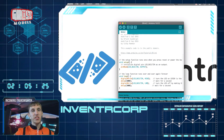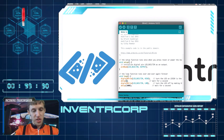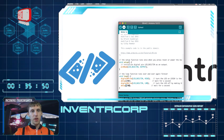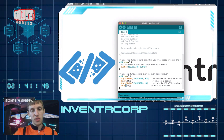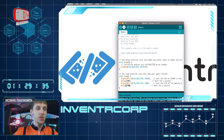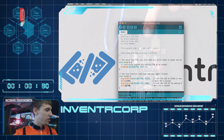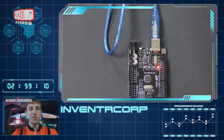To quickly show you guys that example, I'm going to flash it on the board with a different amount than what was previously on there. So if I do instead 250 and 250 and I upload that to the board again, making sure that the USB serial COM port is correct and the syntax has all been verified. When you hit upload, it will verify it for you, so you don't actually need to hit verify each time if you just want to upload quickly. If I click upload now with it changed to 250, you'll notice as soon as it's done, it goes obviously much, much faster — on off, on off, on off, as it seems to zip through.